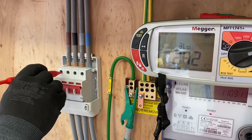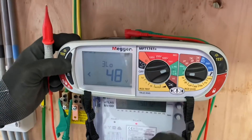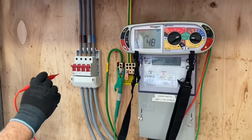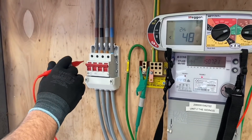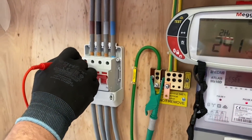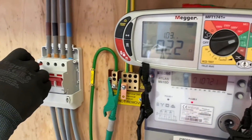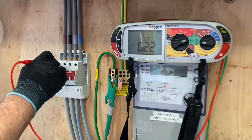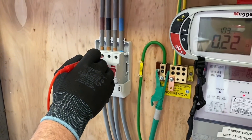We knew it was off so that's good, and we've got a voltage. It was set to three-lead low, so we're going to switch to two-lead HiZ. The reason we can do a HiZ test is because there are no RCDs. On your AM2, AM2S, and AM2E rig your instructor will tell you whether there is an RCD. So with two-lead HiZ — that's considerably less than the maximum. Just remind me what the maximum was: 0.35 ohms.